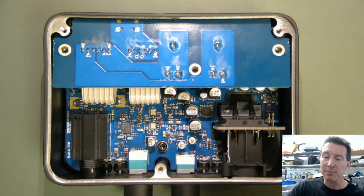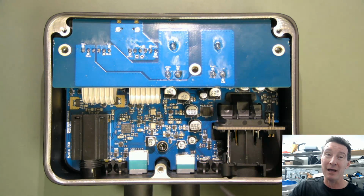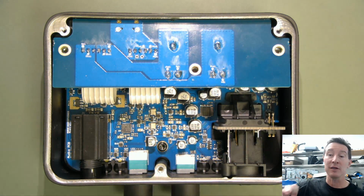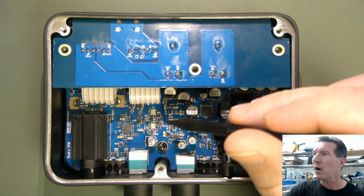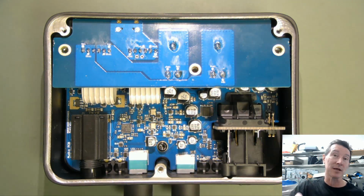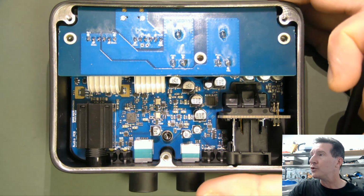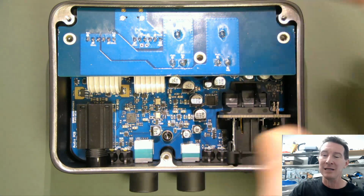That would surprise me, because you want to minimize. You wouldn't go double-sided unless you absolutely have to. You wouldn't have components on the bottom, because that increases your production effort. You've got to flip it over, you've got to glue components, a lot of extra production effort required to put components on the bottom side. So only if you had high density BGAs or something that required decoupling on the bottom of the board would you consider that, or unless you're doing some ultra miniature thing. This thing didn't need to be ultra miniature.